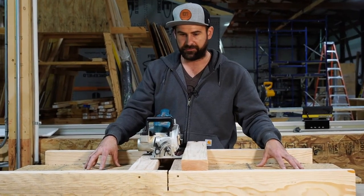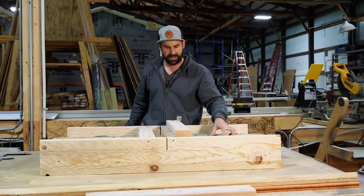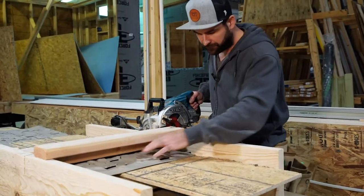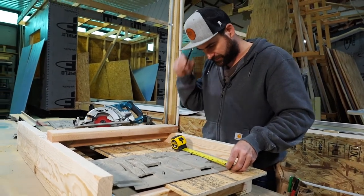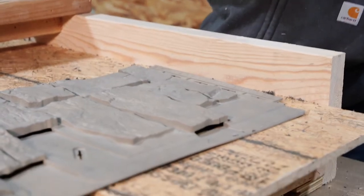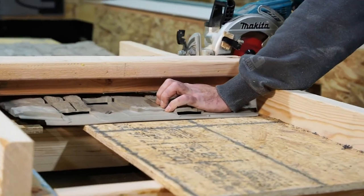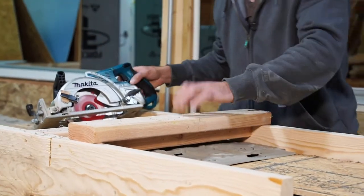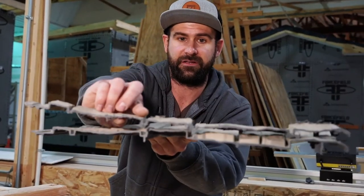So what I have here is this kind of goofy wood box thing, but what it allows me to do is take a piece of siding like this and slide it into my channel here, then take my saw and square up along this back fence here, and it gives me a nice straight cut. Let's say we got to make our final piece and it's got to be 10 inches — I'll use a pencil and just make a mark at 10 inches. Now that I've made my mark I'm going to take it in here and push it through. Because we have this fence it came out nice, and look at the finish — it's a lot better than the finish we had with the other methods.